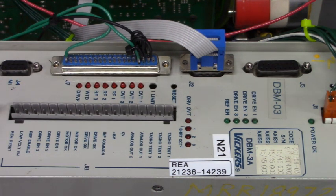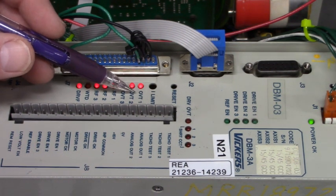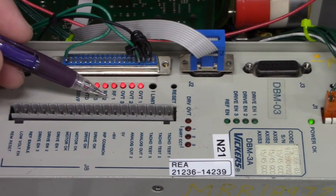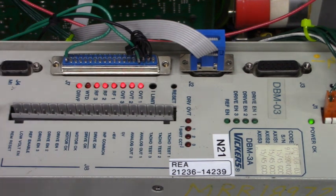I'm going to apply 220 volts AC three-phase to the Vickers bus power supply and we'll see how these LEDs turn on without feedback connected. Look at this — we have over-temp one, two, and three; axis one, two, and three are on; and resolver feedback one, two, and three are on; and drive fault. This is with no feedback connected to J4, J5, or J6.